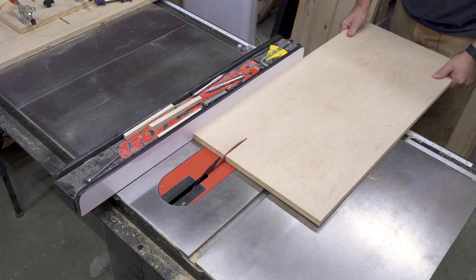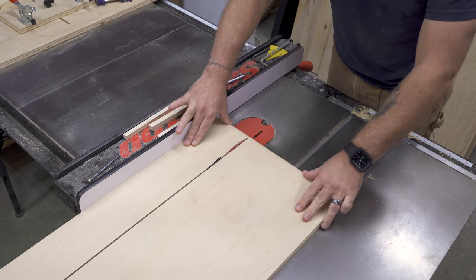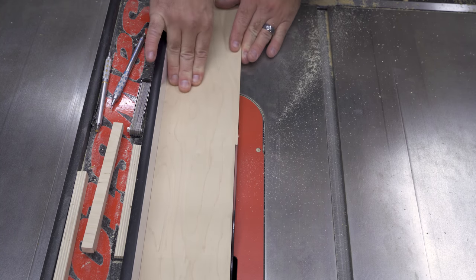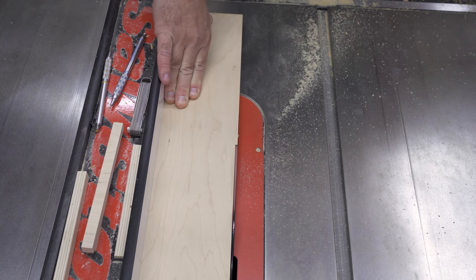What I'm going to do is cut a four or five inch piece off of here at the table saw. Then I'm going to recut that same piece, only taking off the amount of material that my blade is thick. I'm going to do that about two-thirds of the way down, then stop the machine and move on to my next step.